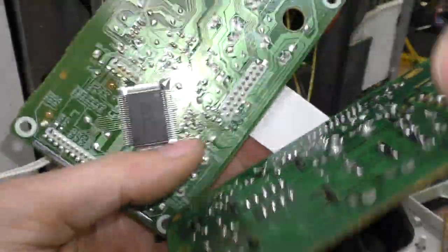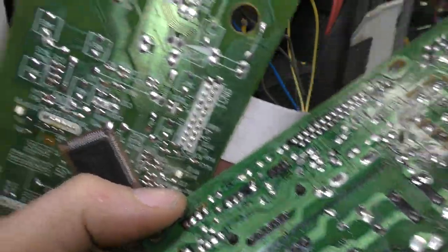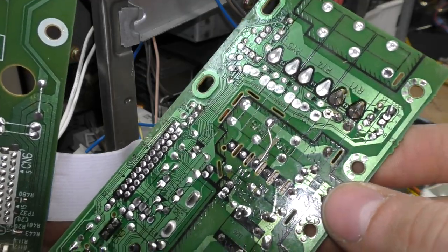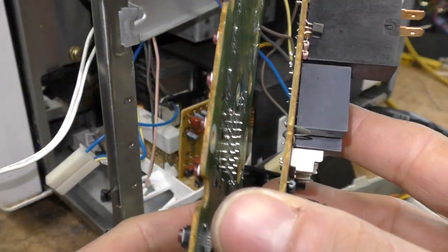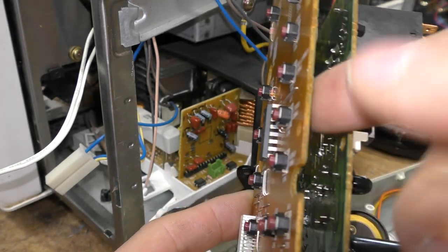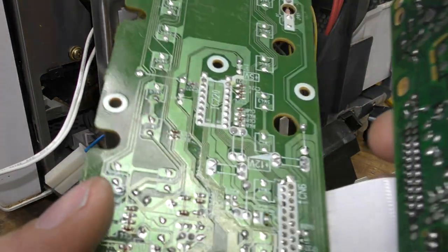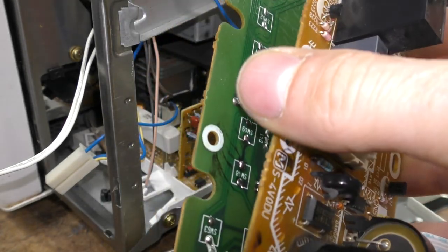The fundamental design issue was simply that they'd used a PCB track as a fuse, which is not in itself a problem — I've seen that in quite a few bits of consumer electronics. But simply the fact that it was just too close to this PCB, so the flash when that track blew up caused a high-voltage short onto this PCB and just killed it. Either a plastic cover or using a proper PCB fuse would have been the solution to that.